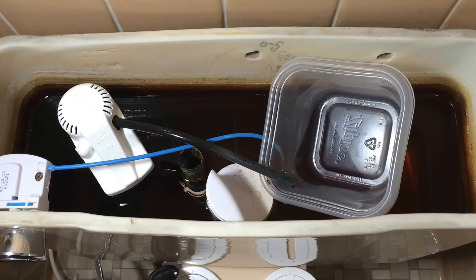Maybe you can hear that noise — that's the siphoning noise I think I'm hearing that has me concerned, but I don't see water moving in this case. What we're after is to see if we've got any water leaks or if the fill valve is pumping more water into the water closet.